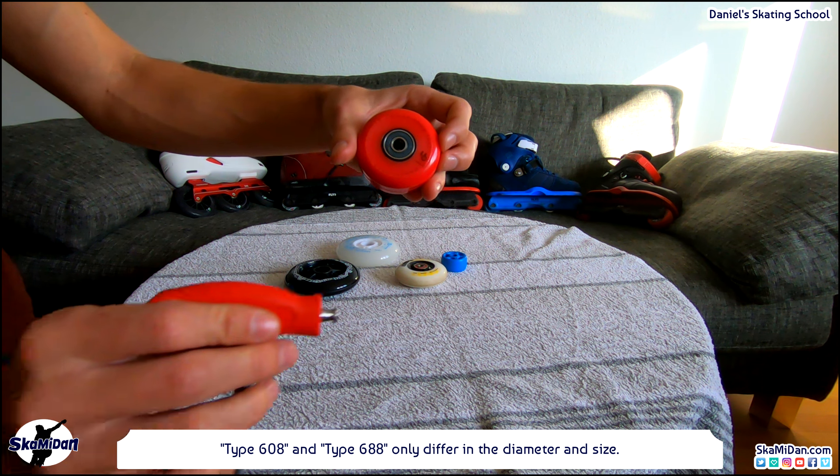When you think about bearings, maybe you will immediately remember the abbreviation ABEC. ABEC is the designation for the precision of processing. The better the processing precision, the faster they are and the better the durability. The number of ABEC starts from 0 and ends at 11. The higher the number, the better the bearings. But anyway, the highest standard for skates is ABEC 9. But remember, the quality not only depends on the ABEC — it also depends on the quality of the used steel, as well as the workmanship, which helps prevent it from becoming dirty very quickly.